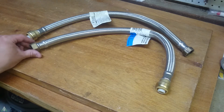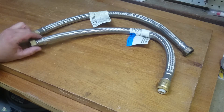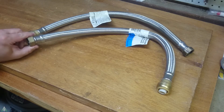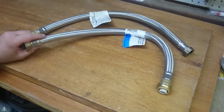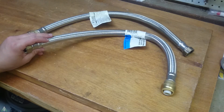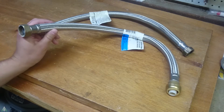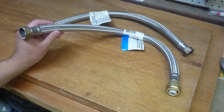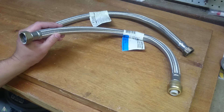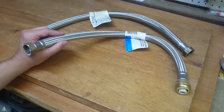So, six-plus years ago when I had my water tank replaced, the plumber used these SharkBite fittings. Inside of these steel braided hoses there is a rubber compound called EPDM — I did my research — which stands for ethylene propylene diene monomer, basically a synthetic rubber compound. Depending on how chlorinated the water is in combination with the hot water temperature, that seems to be affecting and degrading the rubber inside those hoses.